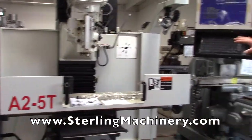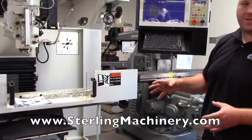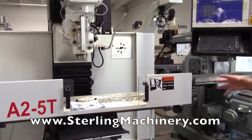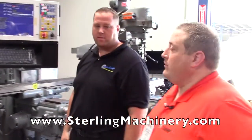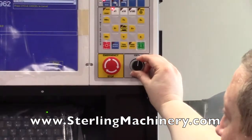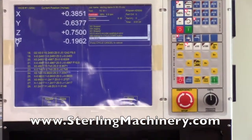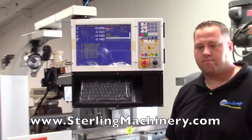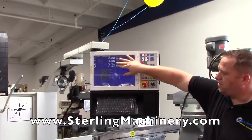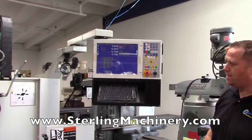Can you change the feed rate? If you notice right now — you've set up your program and you want to increase it a little bit faster for your setup — you can actually do it in this mode. You can use the feed rate override to go faster or even slower, and you'll notice the feed rate changes up here. In this particular case you cannot go faster because we already programmed it at the fastest rate. You have your X, Y, and Z readout here showing you everywhere it's going through, each step of the program — very simple and easy to use.